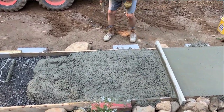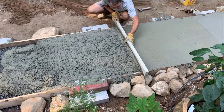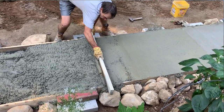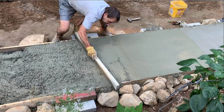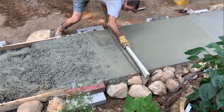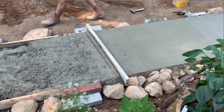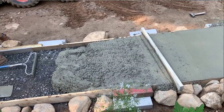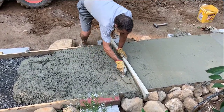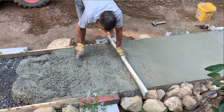You can see there I'm tapping the sides of the forms. Here comes the screeding — go ahead and try to move some material. You don't have to worry about getting it perfect on your first pass. If there's a buildup that's hard to move, go back the other way and push it toward the low spots. If you have too much, use your trowel and place it where needed, continually pushing it down to get as little air inside the concrete as possible.